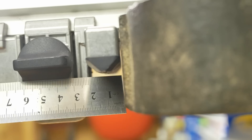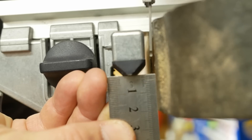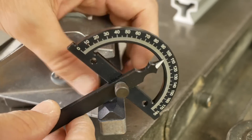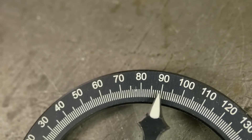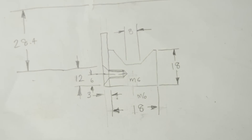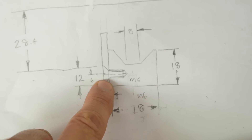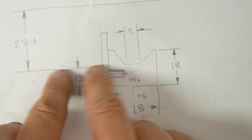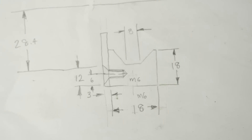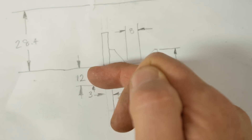So what does this need to look like? It needs to stick out about two centimeters. The throat's going to need to be probably about 12 millimeters thick. The distance down from the top of the table is 28.4 millimeters. I'd guess those guiding surfaces are 45 degrees — let's check — yes, we'll call that 45 degrees. The truncated width is about 8 millimeters. After a rough sketch looking at the profile I need, I considered using an adapter plate, but the existing holes are pretty big and imperial. The easiest solution is just to drill a couple of extra holes in the table and bolt straight through my new profile without needing an adapter plate.